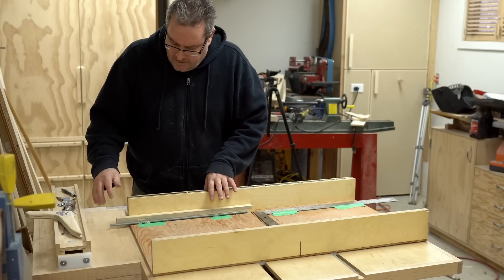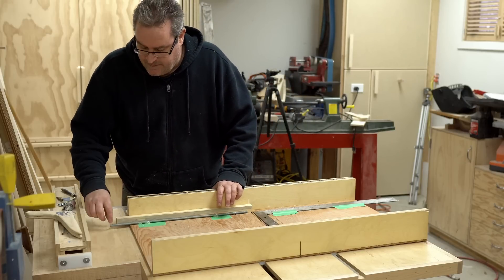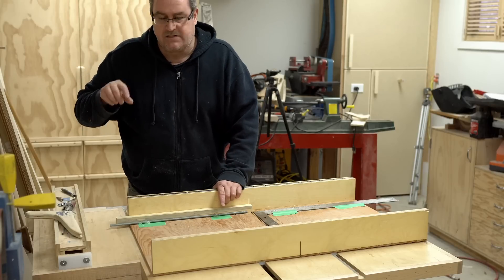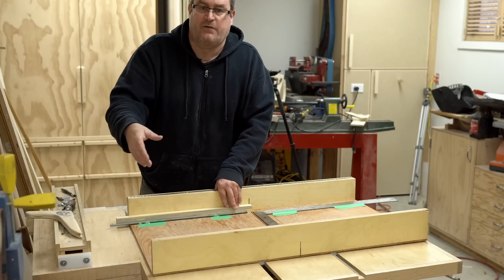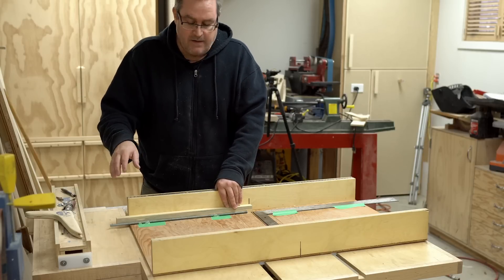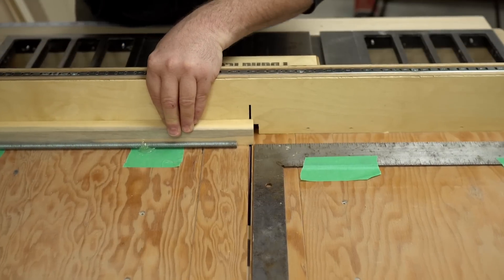I'll go into the procedure. The first thing I want to do is position the blank in the correct place — it should line up at the end of the square — and then clamp the end with your fingers so that you're pushing the screw into the threads. It's important that the head of the screw fits tightly in the threads of the threaded rod. Then hold it down, push it through, make a cut, and move to the next position — which will be a quarter inch away, or four threads on the rod. You won't have to count that; that's what the square over here is for — just line it up with each mark as you move it through.